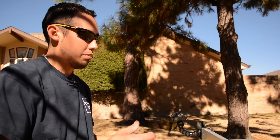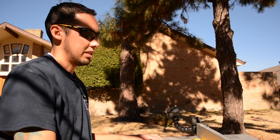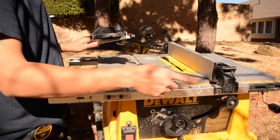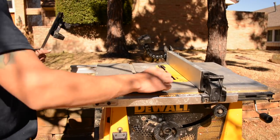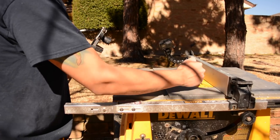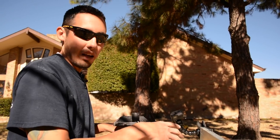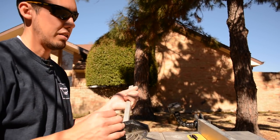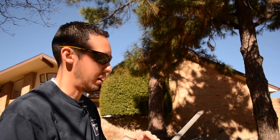If you're going to do it this way, you must have a miter gauge — that's this tool right here. This slides through because if you're trying to hold that piece through a small area between the blade and the fence, you can get a pinch in there and it'll kick back, and it's very dangerous. So if you're going to do it, you need this to support that board.